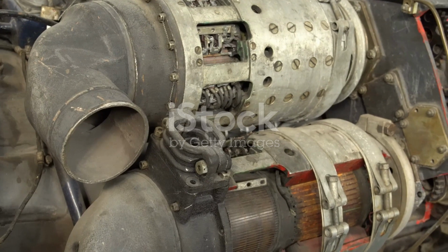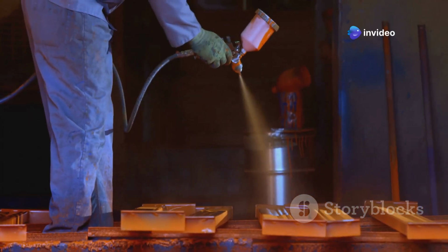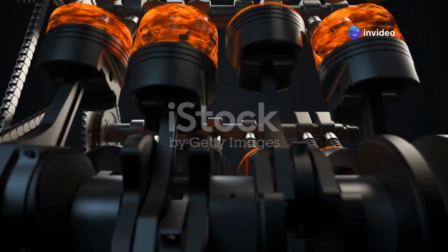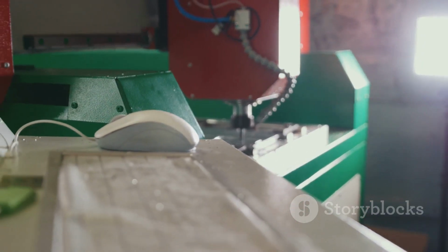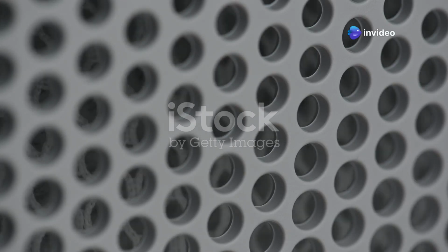As the cylinder barrels wear due to use, they can be repaired by chroming. This is a process that plates chromium on the surface of the cylinder barrel and brings it back to new standard dimensions. Chromium-plated cylinders should use cast iron rings. Honing the cylinder walls is a process that brings it to the correct dimensions and provides a crosshatch pattern for seating the piston rings during engine break-in.